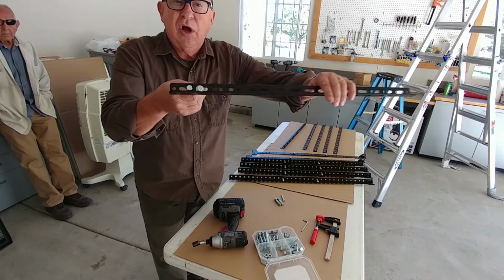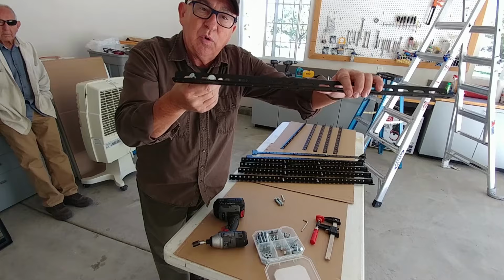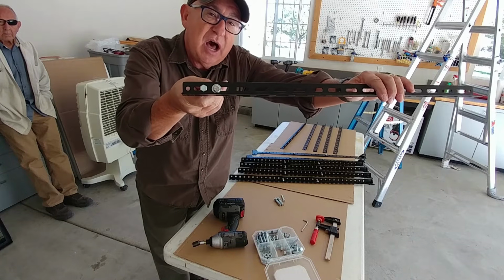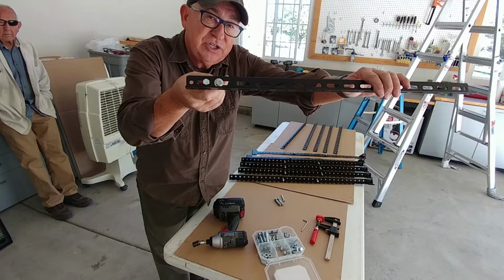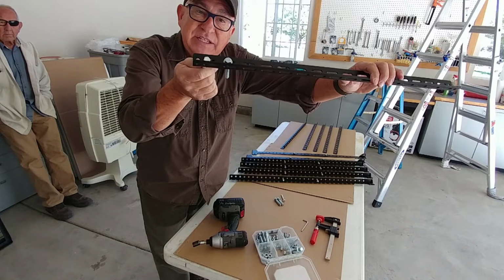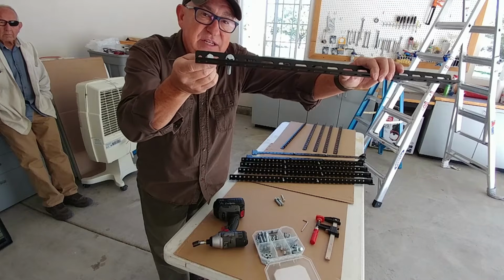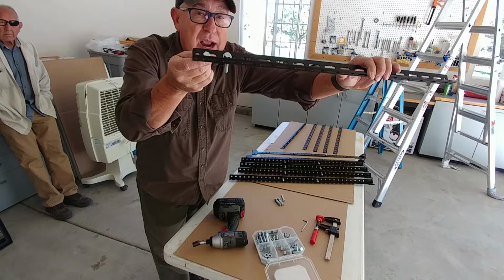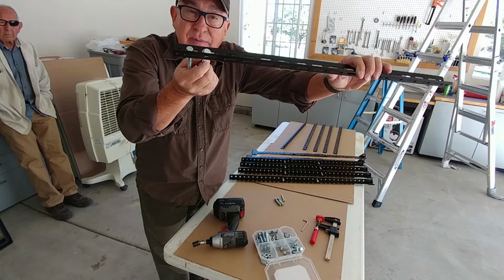You can see on your right, this one has a washer under it. Look how much better the contact is and how pressure is distributed across the bracket versus just using that by itself, where I think it would have more of a tendency to pull through, or you're putting a lot more weight on a smaller area. The washer does a better job of distributing the weight.